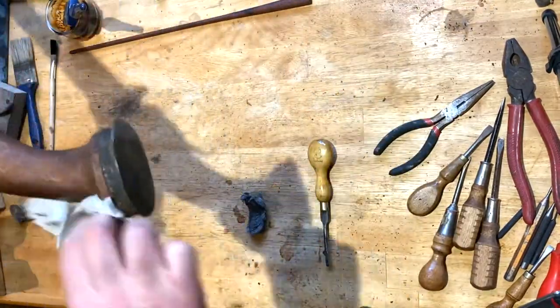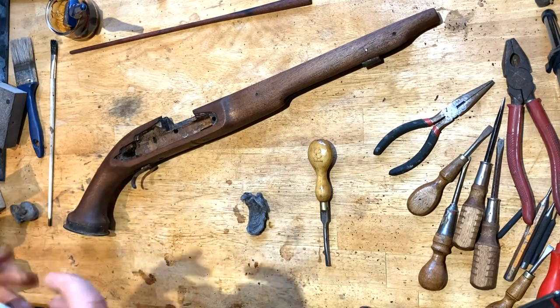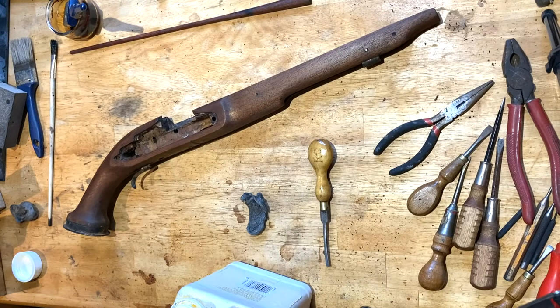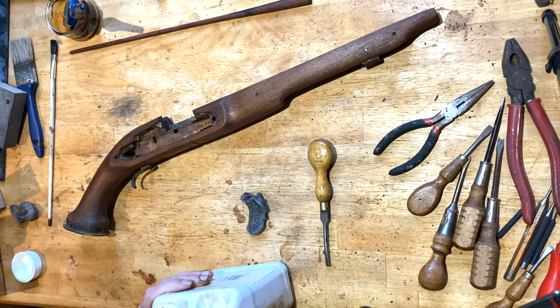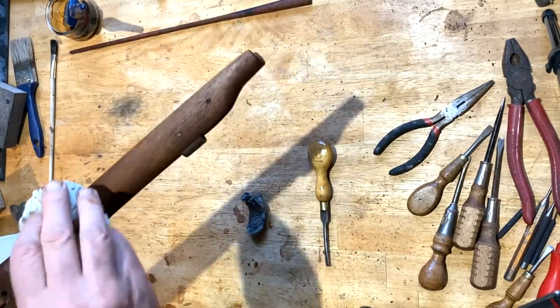Oh yeah, it's not so rubbishy now, there we go. I can actually tell that's evaporated while I've worked on it, so I'm thinking about wadding up a bit of this and making a little polishing button. And I'm thinking I'm going to use a clear button polish on this. It's actually dark enough. Off camera, just shaking up the bottle. Okay, special pale French polish. There's not a lot of colour to it. And we're not actually French polishing, all we're doing is sealing the grain for the purposes of those who want to know. But look at that pop.